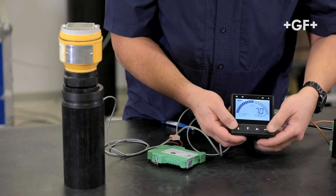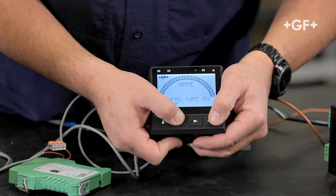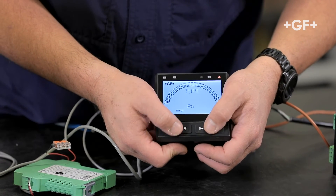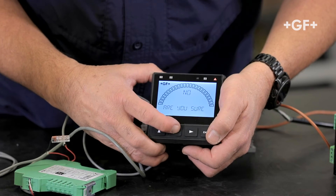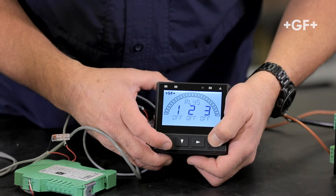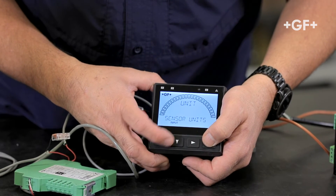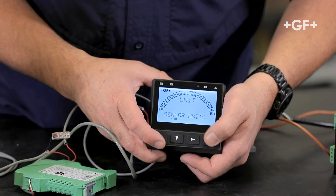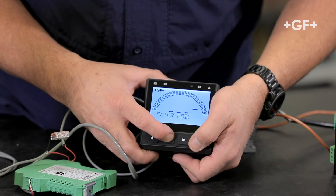This was set for pH, so let's tell it that it's going to be a 4 to 20 device. Go into the input menu and arrow up to type. Change it from pH to 4 to 20 milliamp device and press enter. All settings will be reset — yes. Press and hold enter to configure. Under input and sensor units, we can change the unit to read inch. 4 milliamp is zero, and for 20 milliamp, the default is 5 — I'd like that to be 24.